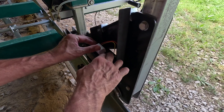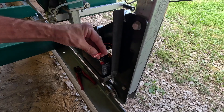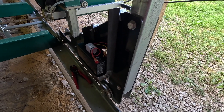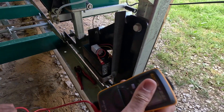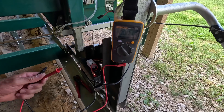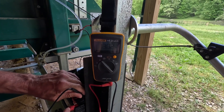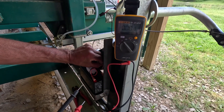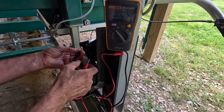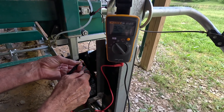Let's put some Velcro on it to hold it down — that should work just fine. Plug it in. Now let's double-check and make sure it's doing what it needs to do. We'll take our handy Fluke meter, set it for DC volts. First we'll check our battery, which should be 12 volts — it reads 13.03, that's fine. Now let's check what we've got coming out of this adapter. Assuming red stays positive — it reads 3.25 volts. That's perfect. That laser module can use that without burning up. Everything looks good so far.